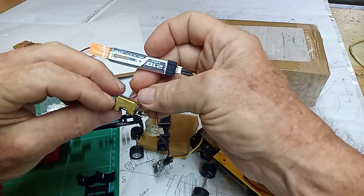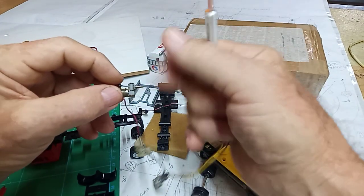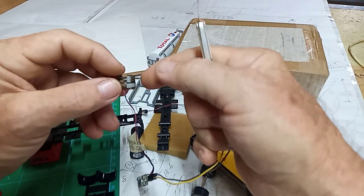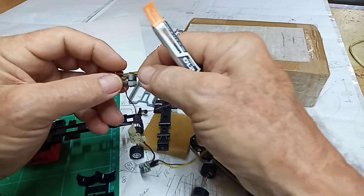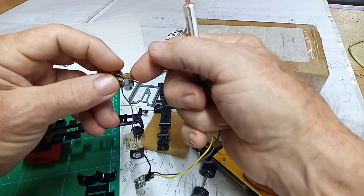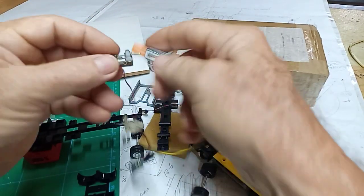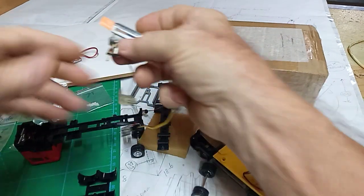Just folded brass again with the holes drilled. These two gears are all on one shaft fixed together. It goes worm drive, 13 tooth worm drive, and another drive gear inside under there. Very hard to see, it's so small. Now I'll just turn that off.